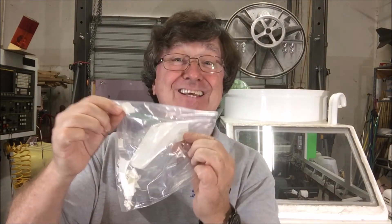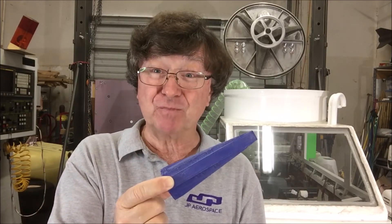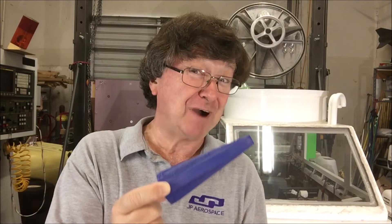We record the flight with a high-speed camera with a black felt background. This was flight number eight. A Mach 4 shock wave or a 1200 g acceleration is hard on a little printed plane and sometimes it doesn't quite make it. Even in pieces, the Dart moves pretty fast. We usually get four or five flights out of an airframe — only one if we miss the box of bubble wrap.